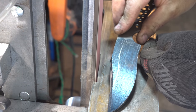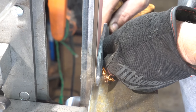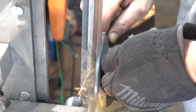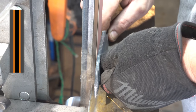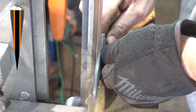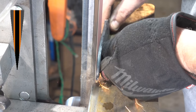I'm going to take this opportunity to answer a few questions that came up during the Copper Damascus Bowie build. First off, a few people asked: once you sharpen this for a while, aren't you going to reach the copper? Here's a picture showing the cross section of the layers in the knife. Once the bevels are ground in, it's going to look like this. If you keep sharpening, you're just going to move that bevel up, exposing more of the core. You'll never reach the copper.